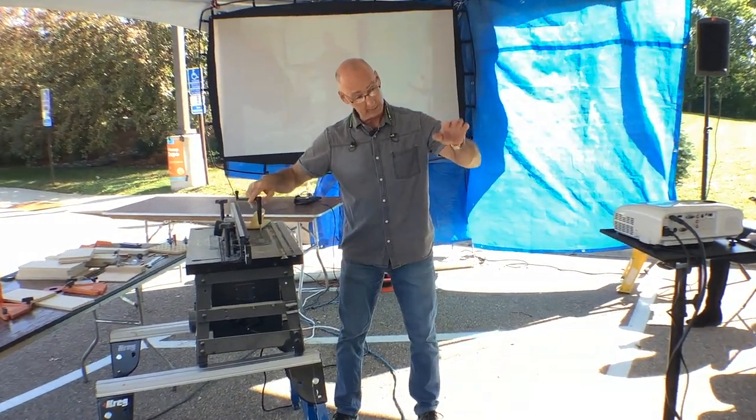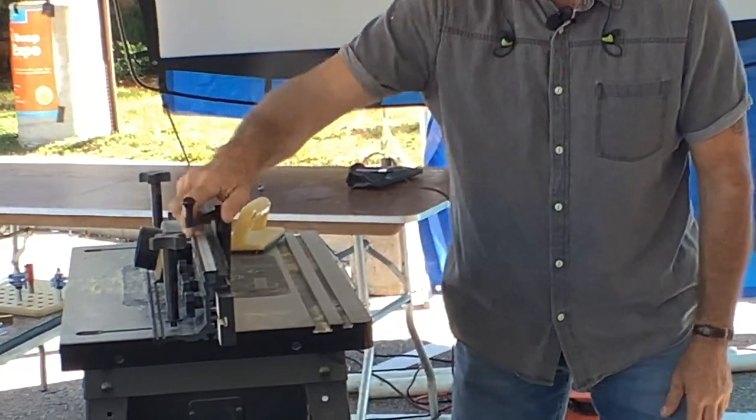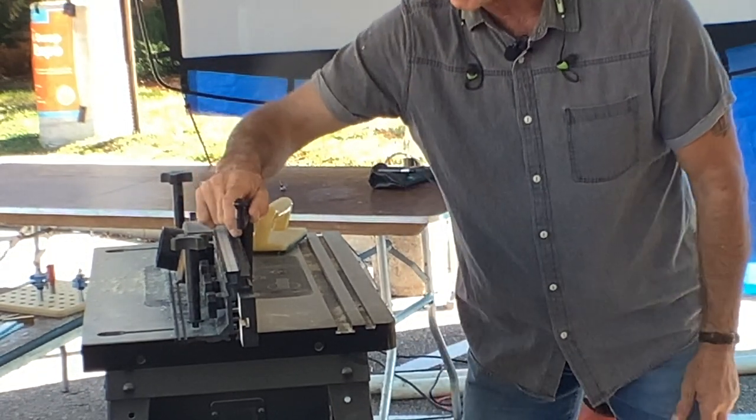I have to go down, so remember that whole backlash in the system concept. So I'm going to go down probably too far and then come back half of that.